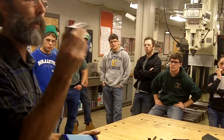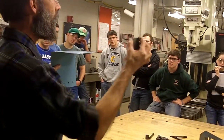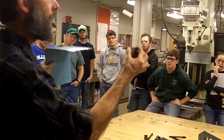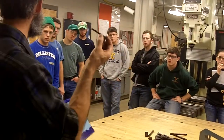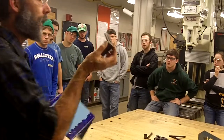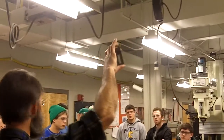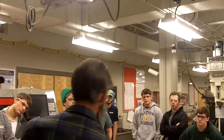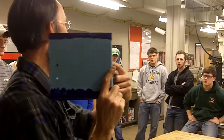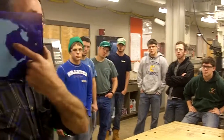If we get both of our pieces of angle iron very accurate, we can put one side in one vise, one on the other side of the vise, both tool rests at the same time, do our layout and mill our slot. As far as the layout for the slot goes, our angle iron is 3-inch angle iron. Same distance as between my fingers now. Find your center line on your 1.5 inch width, scribe it down. What's going to be this distance?